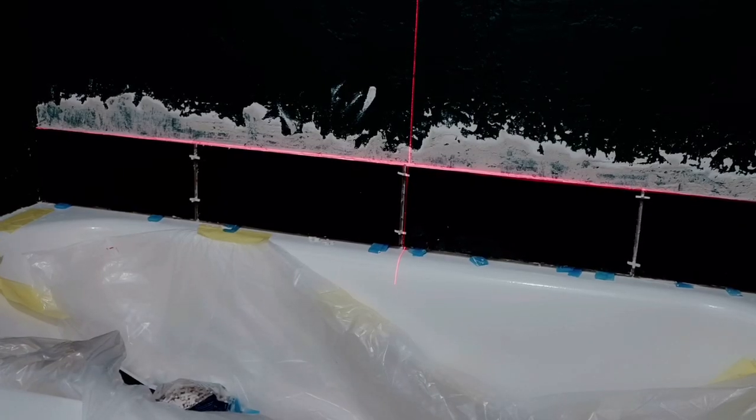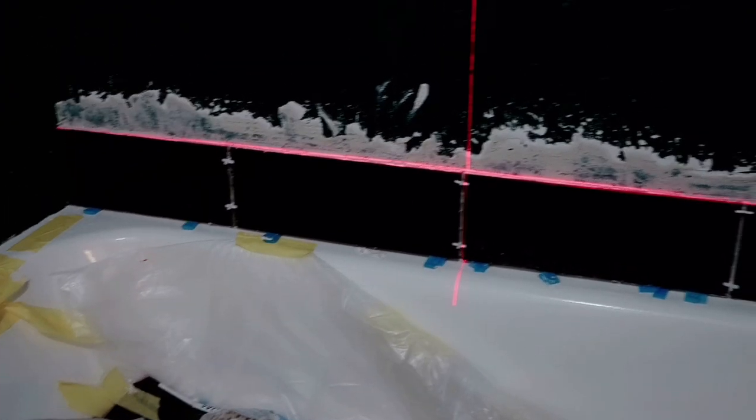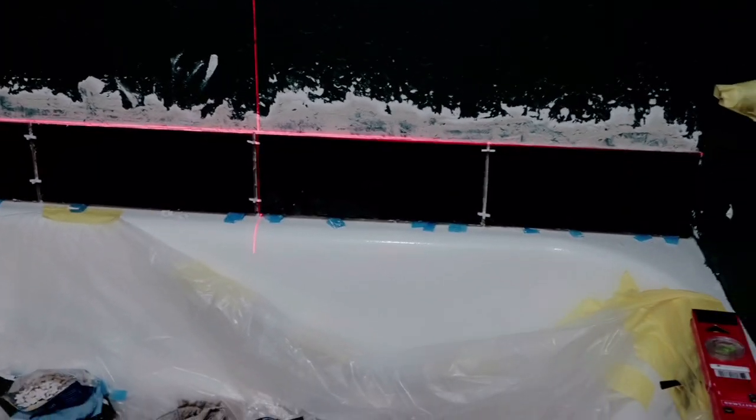Before I put the tiles around the tub, I poured a full tank of water into it and let it sit overnight. That way helps to start the bottom row with the right level. To put the tiles on the wall, the first row is very important. I used the spacers to support the tiles and also give the right space for the caulking line.